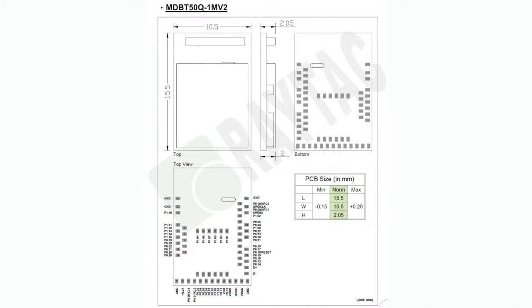On other boards I recommend going with the MDBT50, because I use it — it's a great module. It's fairly small at 15.5 by 10.5 millimeters. It does have a bunch of pads in the middle, but there's lots of space inside for vias or routing traces through. You can route the traces through with a 6-6 mil rule — it's not a big deal at all. You get all the pads brought out, and it's got a tin to protect all the components.